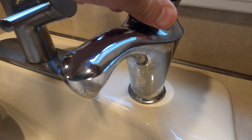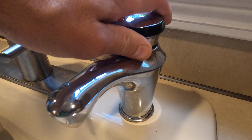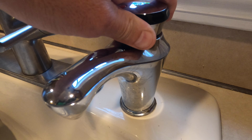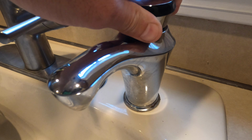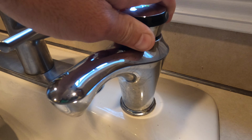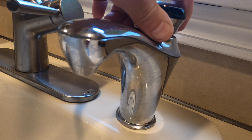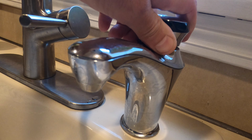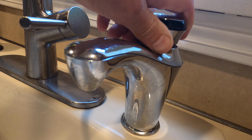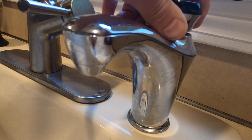And we'll check for leaks. There will be no leak because everything is really controlled by the head here. This controls the water valve, controls the flow of water. So we're going through the filter. Filtered water is going into the tank. The tank is filling up, and eventually will come out this nozzle here. You'll see in a minute. You'll see how it comes out. And then once this is full, we'll plug it in, and then it'll start heating up and we'll get instant hot water. Here it comes. Here we're coming up, getting full now.